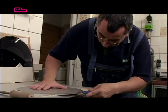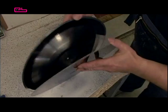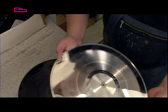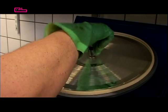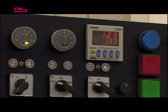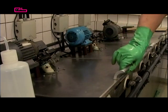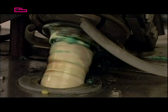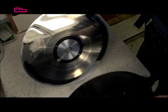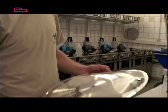When electroplating is finished, the newly developed nickel plate is separated from the foil and is now called the negative. Since no further replicas can be made from the foil, another step is necessary. The complete electroplating process is repeated with the negative. At the end of this process, the positive is developed, the so-called mother. From this mother, several negative copies are produced, which are also called sons or stampers, and are used as pressing templates. One template is good for manufacturing approximately 1,000 discs. With this, the electroplating process comes to an end, and the first negative is prepared as a mould.